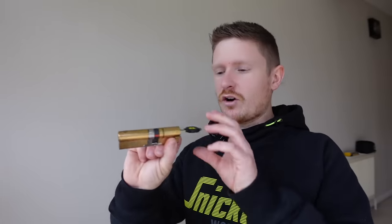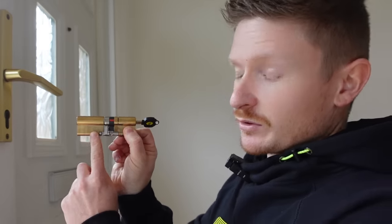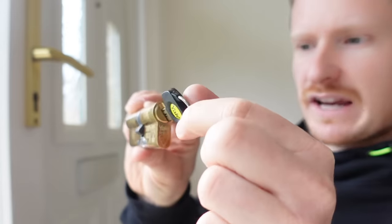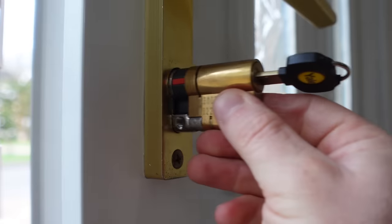We now have a nice shiny new lock, and there's actually a lot more to this lock than it looks — more on that once it's fitted. To install it, you can see the lock has 'external' marked on it. Make sure that little lug is parallel with the cylinder, then slide the lock into the handle and feed it through the door. Give it a little wiggle and it should pop in nice and easy. You can confirm it's in position by working the mechanism — if the lock is functioning, it's seated correctly.